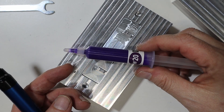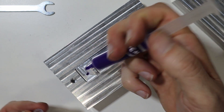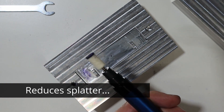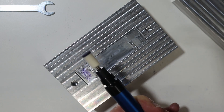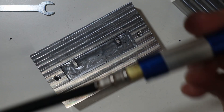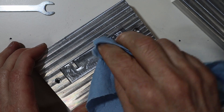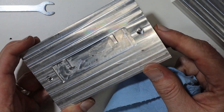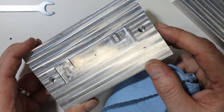Here's the 20 micron. Actually, I should probably put this on the end there rather than on the work. It goes up to 56,000 RPM. You can still see the tooling marks a little bit if you get the angle just right, but it's a lot better than it was before. I wasn't really that happy with the air pencil — with the high speed and the low power, I didn't have as much control as I wanted, and it also tended to fling the paste all over the place.